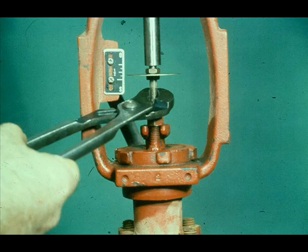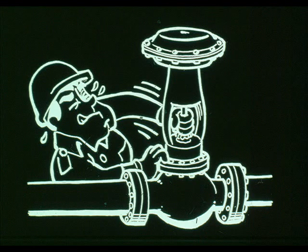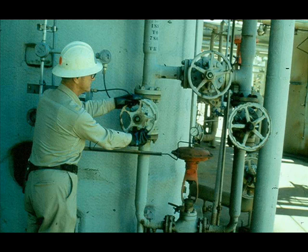Apply the signal air that should close the valve. Turn the plug stem until you feel the valve plug seat. If you feel excessive friction, the valve is already seated — do not turn it anymore. Return the valve to service. If it continues to leak, disassemble it and check the trim. Repair or replace as necessary.